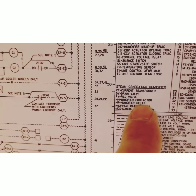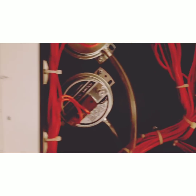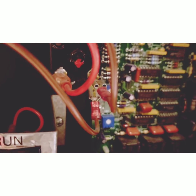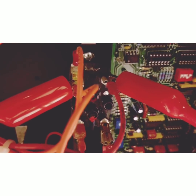I'm wondering if that switch is closed, so I went to the humidifier relay. The coil wires are at the bottom and the normally open switch is at the top. We were energized — 24 volts across that coil — so that normally open switch should have switched position. It didn't. It was open when I came over, so I jumped it out.